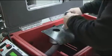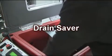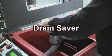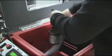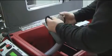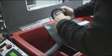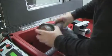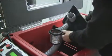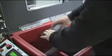Remove the gray hose from the drain saver basket. Check inside the hose to make sure that it is free of dirt and debris. Also, check the gasket covering the drain saver. Once this is done, check the drain saver itself. Make sure that it is in good working order and free of dirt and debris. Next, check the drain saver bracket assembly and also the recovery hose. If you find any type of wear or damage, replace accordingly.